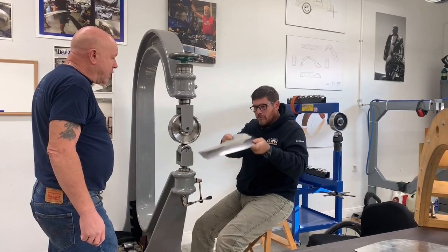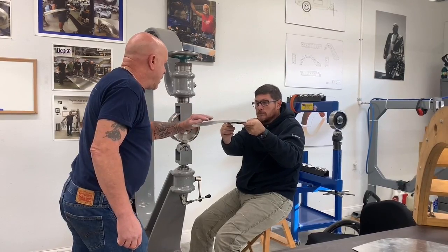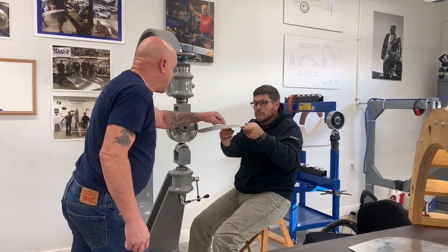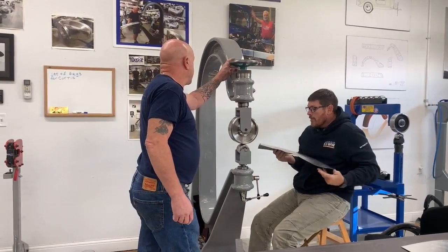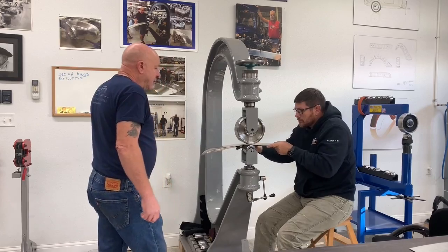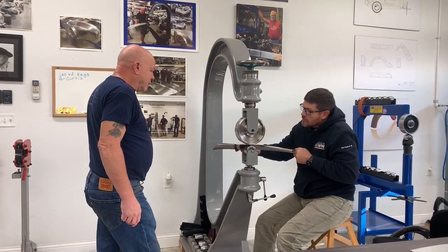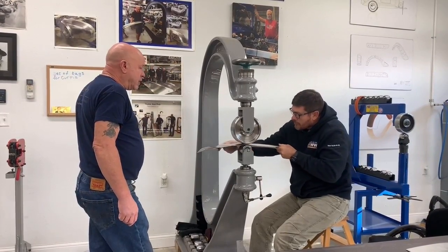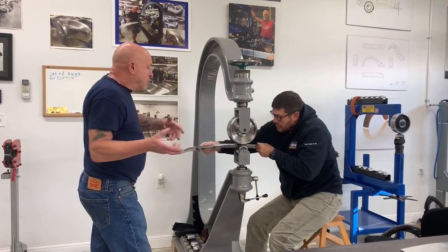So we'll do a little bit more wheeling. But you can see now where we had this really big waffle edge in there, it's slightly picked up and it's still maintaining fairly flat. So you're going to come a little bit closer to the edge, and we've got a little bit of pressure on it, so we still know that we need more shape because we had a couple of hollows in it. And when you've been doing this for quite a while, you'll get into more of a rhythm, and it'll be more of a flowing action.